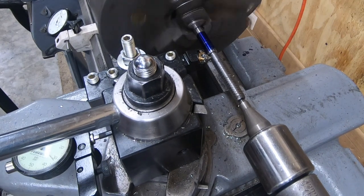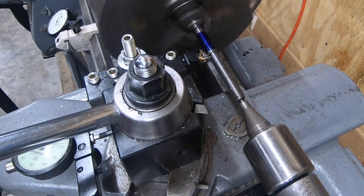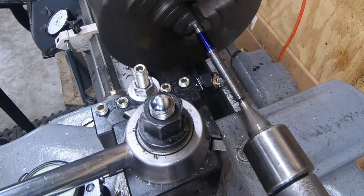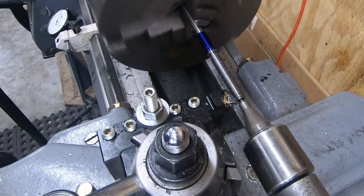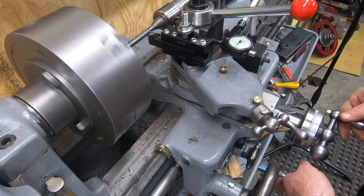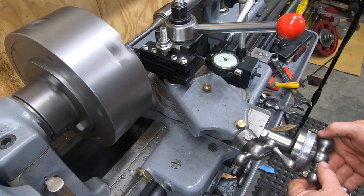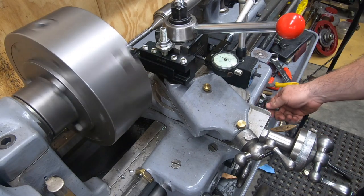I'm about 82 thousandths of an inch deep here, which is a lot deeper than what the math suggested I should be going. Not sure exactly why that is. It may have something to do with that national special thread designation.